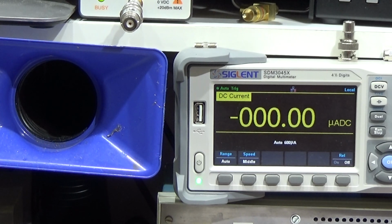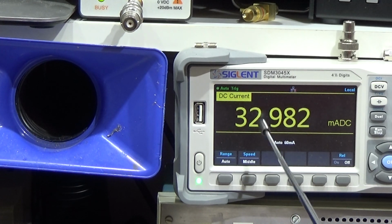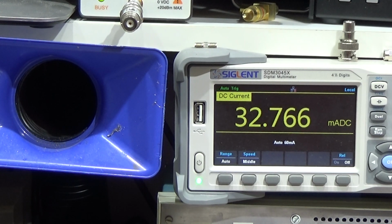Now I'm really connected over my amp meter, and let's see what it means. And that is what's happening. I do not know if you have heard the relay clicking in the PA, but now the PA is switched to transmit. You see here the 33 milliamps at 115 volt, right? That could potentially spark in your modern radio and really kill the circuit in your modern radio. So therefore, never directly connect a PA to a radio.